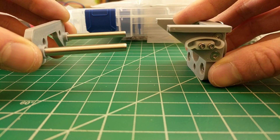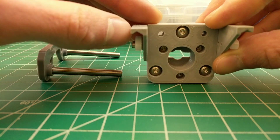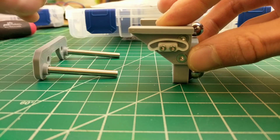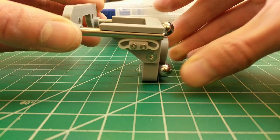The way this works is that I've got these little v-grooves on the side. I call them wings — there's two little wings — and then there's these little flexures here. What happens is that as I push the pin into here, the flexure deflects and just locks it in. It's very secure.